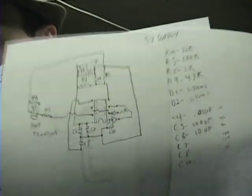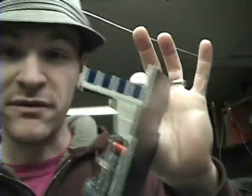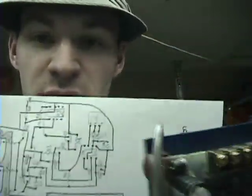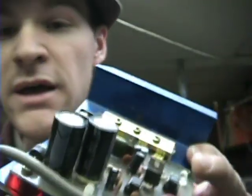Here's the diagram for the pulse width modulator. I haven't actually built this fresh — I traced it off what I already have because I don't have the original documentation from so long ago. This is what this board is — it's an old amplifier I hacked and used as a heat sink. You can see I actually etched this circuit board — right there is my name, RWG. At the time I didn't have the right tool, so I took fingernail polish, marked the traces, and stuck it in acid to etch it out.